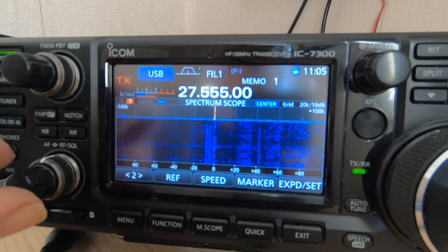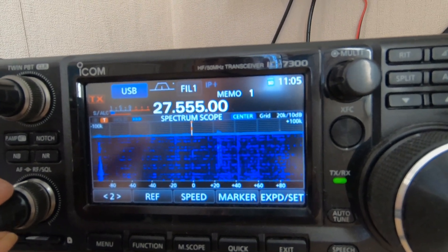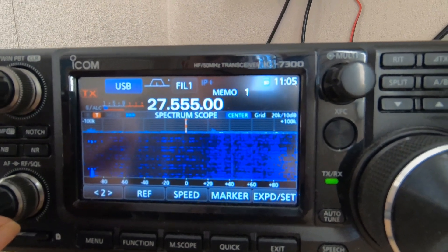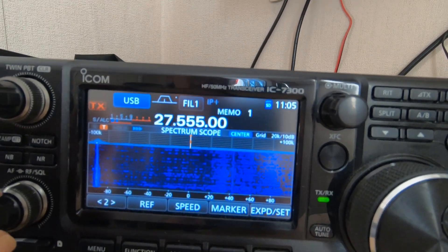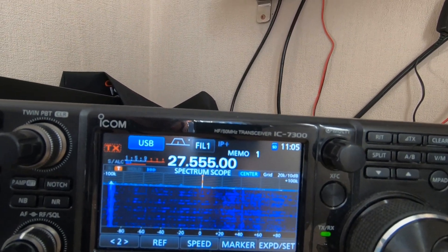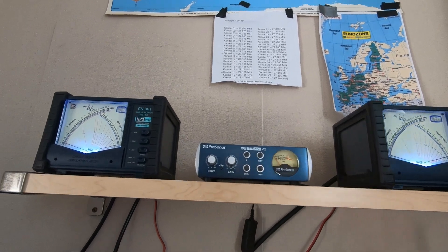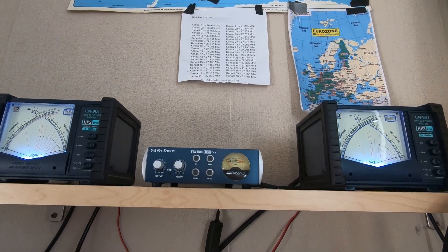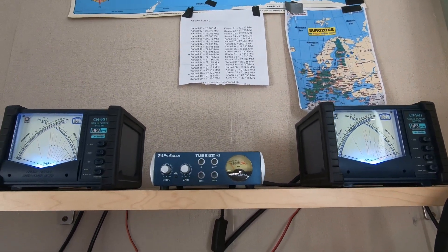So it's now 5 past 11. Basically, you'll lose 4 watts on 25 meters of cable at 30 watts. Times it by 3 and I suppose you'd lose about 12 watts on 100 watts — or thereabouts. But these aren't laboratory meters, as you well know — these are for amateur radio, amateur kind of meters, so they're not so accurate. But it does give a general idea of the loss.